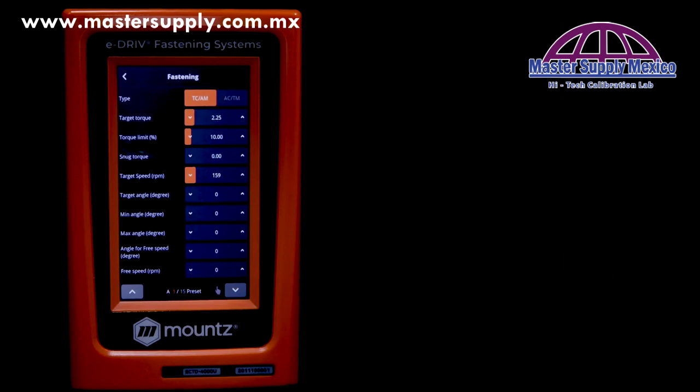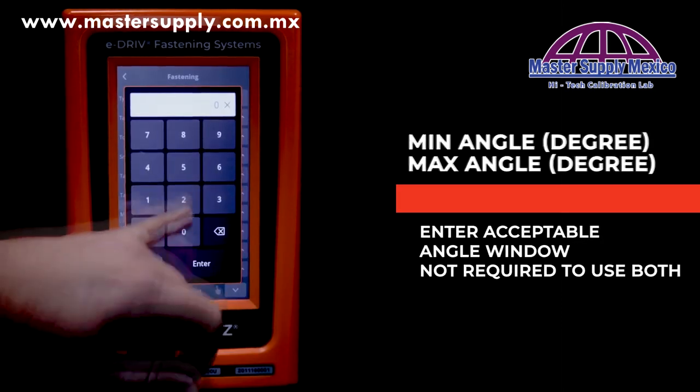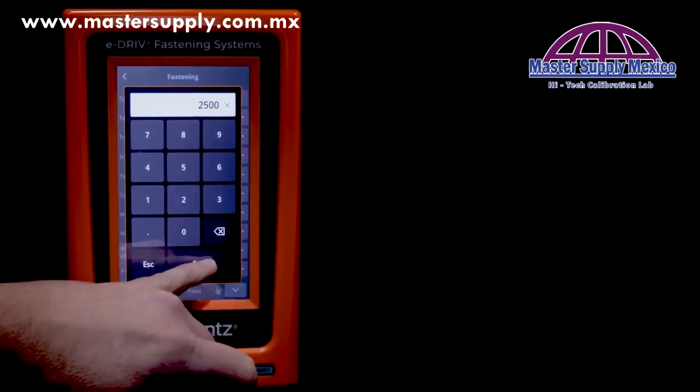Now, next is where we can set our minimum or maximum angle for the angle monitoring portion of the rundown. Now, if both of these values are left at 0, then the angle monitoring will be turned off.